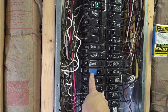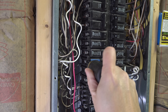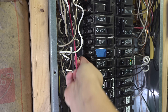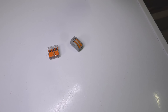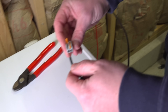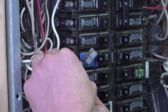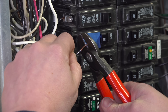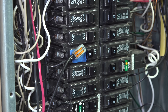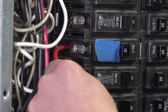Now we've just got two connections left. We go to the circuit breaker we want to power — that's our heating system — and use a screwdriver to loosen the wire feeding the breaker. We carefully slide that black wire out and connect it to the black wire on our switch using either a wire nut or, in this case, a WAGO connector. These give you a secure connection and you can remove them at any point in the future. The wire has to be the exact right length — if you don't know, flip the connector over, there's a guide on the back. Match up the length, cut it to size, insert it into the WAGO, and close the lever down for an instant connection. You can certainly use a wire nut as well, but make sure you do it correctly. Finally, the red wire gets inserted into the original circuit breaker — once it's completely under the terminal, tighten it down securely. Make sure you're not getting any of the red insulation under the connection.